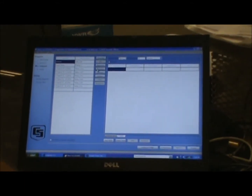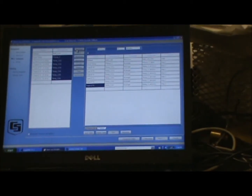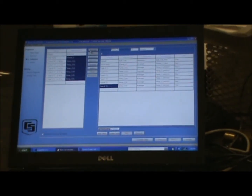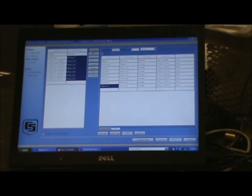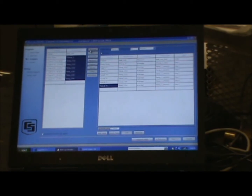We'll measure the minimum battery voltage, so we just click on battery voltage and add that to the table. And we're going to measure the panel temperature and all six temperature probes every 15 minutes, taking the average of those. The data logger program will scan every five seconds and store those readings in temporary memory, then every 15 minutes it'll take the average of that temperature.